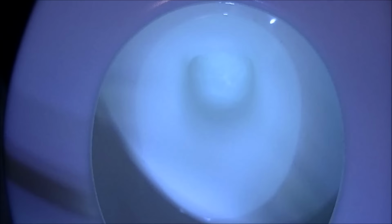Alright, the first indication that I had a problem was right here. You see the water in the bowl kept having ripples in it. Five minutes after I flushed the toilet, it would continue to have a ripple in it. You could see the water had waves in it all the time, and little ripples from the edges. You can use a flashlight or just normal light if you have good enough light, and you'll see it. You shouldn't have any ripples in that water whatsoever. It should be totally calm